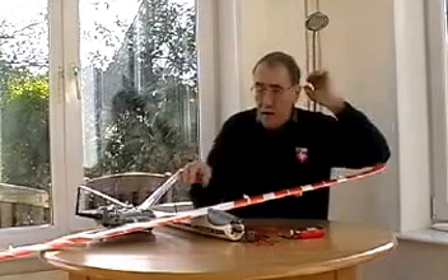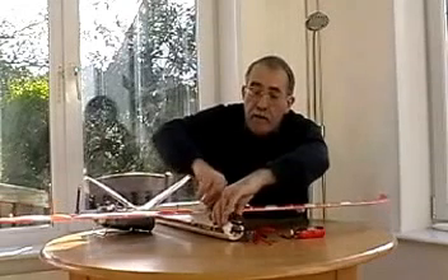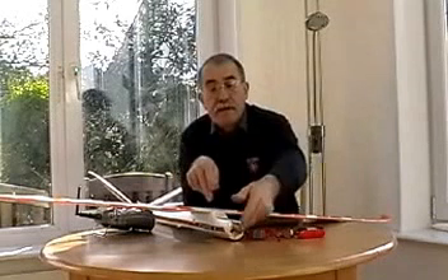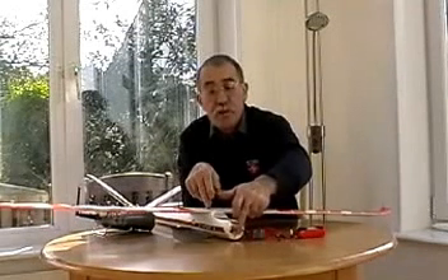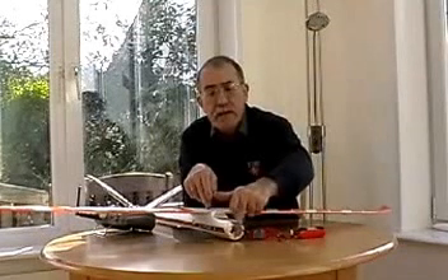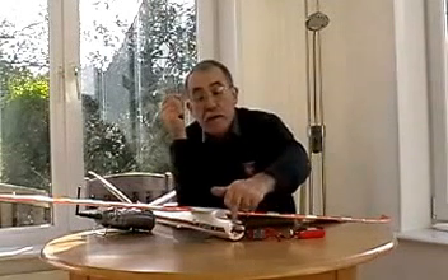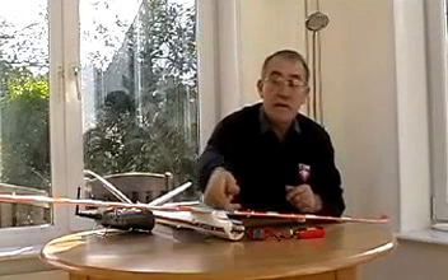So I have to de-power that and make it safe. With the front coming off, after we really looked at it, the plywood supporting plate was broken off — only two tiny bits left. So this plate is not adequate for the job. It needs a smaller hole in the front area. There is also a square channel in the front, similar in size to the square channel that holds the carbon fibre tube at the back. So I'm going to add a piece of hardwood in the front, to which I can screw the bottom side of the new nose cone, which I will fit.